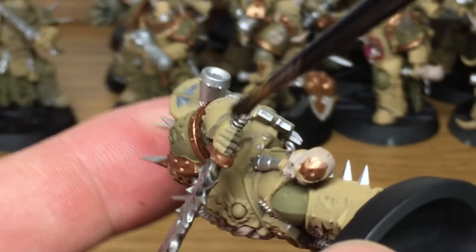So it's always worth just keeping an eye on your brush, and when it starts getting splayed give it a rinse out and then start again with it. We're just going to add this to the areas of corrosion on the knife, maybe a few of the little sunken areas that aren't getting any abrasion or cleaned at all.